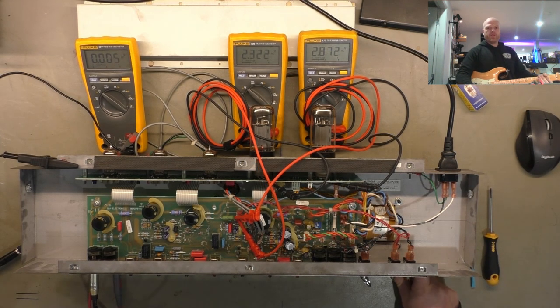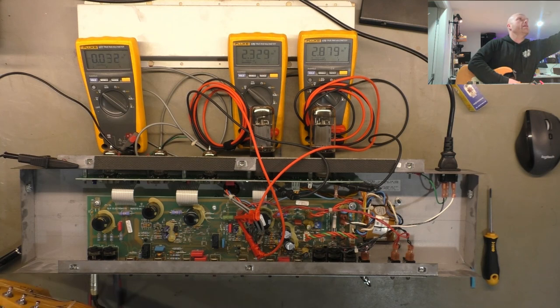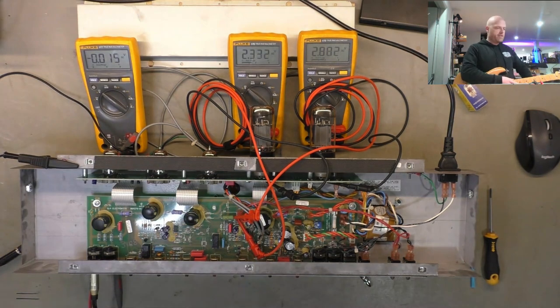So it seems to be going for that Blues Deluxe, Hot Rod Deluxe, Classic 30 type of market, where the overdrive is pretty smooth via EQ. It's rolled the top off a bit and rolled the bottom off a bit as well, sort of very mid-bass distortion. Reasonable amounts of gain, but not much top end to the overdrive channel. You can tell there's probably a bit of snubbing happening there.